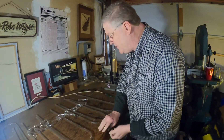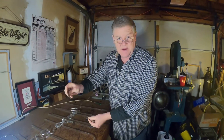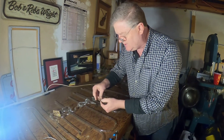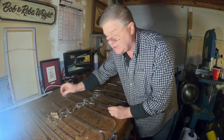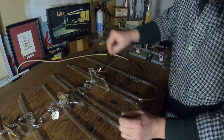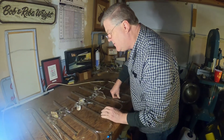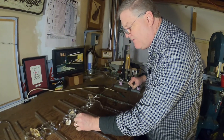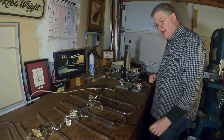On a unit this large, when you've got things close together, this is mica — this is actually how it comes out of the ground. We put a piece of mica between any place where the glass is close so the electricity doesn't jump, because then you get a hole in your tube. We hook it up, and we're going to slowly heat this to over 500 degrees and put the vacuum on it to take all the impurities out, because you have to have a clean tube before you fill it.